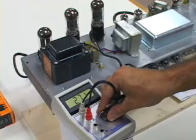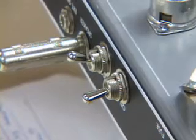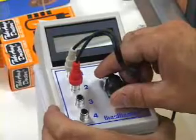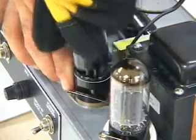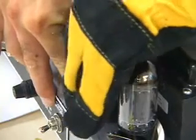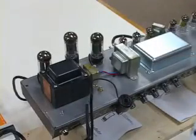Check again to make sure they're both in the same neighborhood — they're still within a milliamp, so that's a pretty well matched set of tubes. Turn the standby back off, the power switch back off, and shut down your Bias Master. Then remove the tubes, which are definitely hot now, and the Bias Master socket, and put the tubes back in. Do the same for the other tube and you're done.